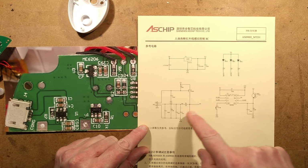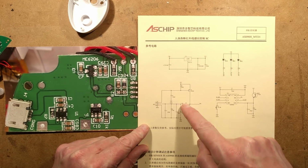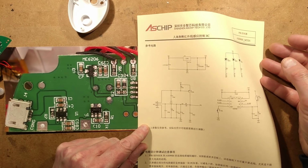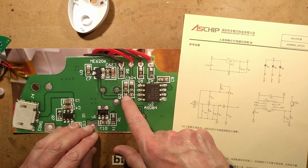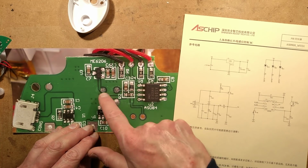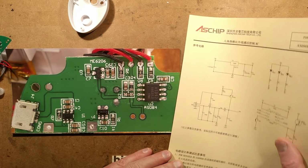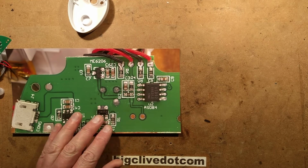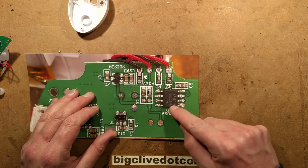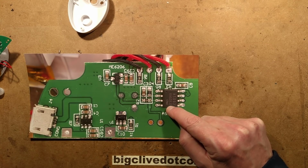Another thing is this one, the input to this shows the passive infrared sensor with all this buffering and amplifying filtering circuitry around it before it goes into the actual unit. But in reality, there's very little between the passive infrared detector. It's basically a resistor and capacitor, and then it's going straight in, and the other side of that is just the supply voltage. So this chip is a non-standard one. It's not documented. It's combining the passive infrared detector with all the excess circuitry removed, and then ultimately it's just driving the RGB LEDs directly. So that is very much just custom designed for this task.